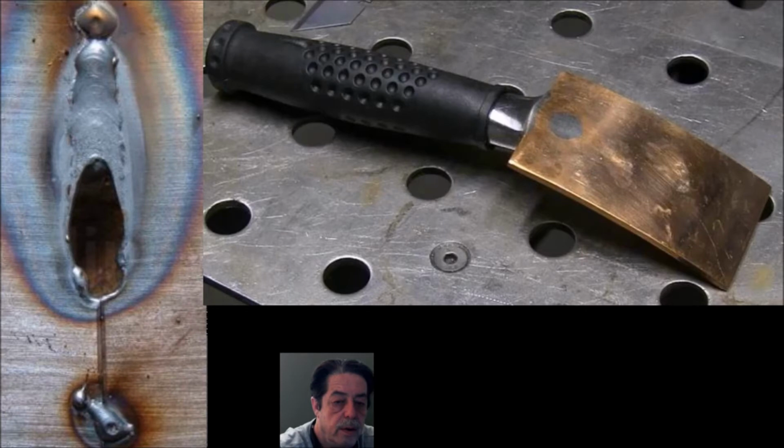Now, whether it's on an automobile or a flat piece of steel, it doesn't matter. Make sure that you have that temperature down to the appropriate gauge steel or maybe a little lower. Get your MIG gun down there and then hit the trigger and just zap it. Just a quick flick of the trigger and zap it. And it'll create a little nubby weld looking thing on there. Let it cool a second and go over to the left. Do it again. Then go to the bottom, let it cool, go to the top, and keep bouncing around until you fill that hole.